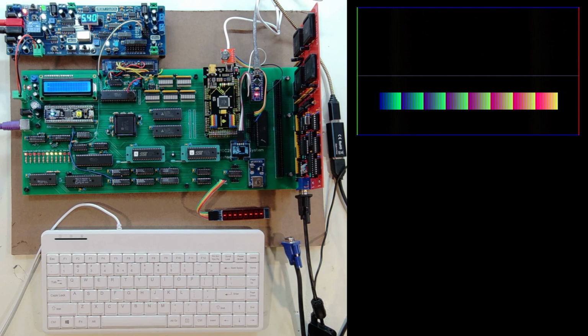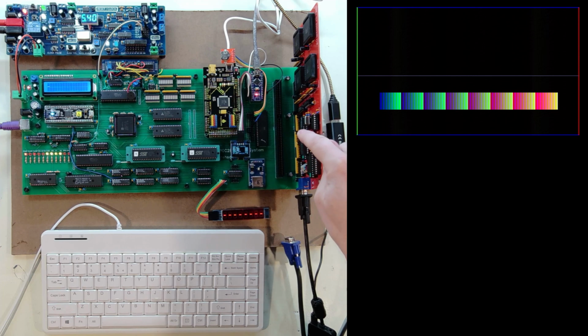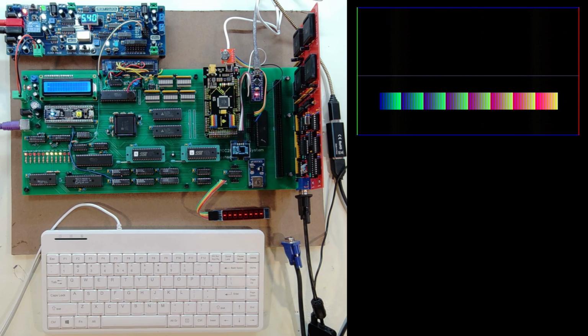That's probably it for this video. I've spent about half an hour here just going through how I'm accessing the memory, how I'm starting to program it, and showing the current output, which honestly, I'm happy with. I'm not seeing a lot of artifacts. The only minor issue is the very first column. I get a little bit of noise, but I think that really comes down to how I've done the timing for my vertical and horizontal refresh signals in my PLDs over here. I could probably tweak that, but it's close enough that I'm really happy with what I've got. And the output both to my LCD and within OBS are picking it up nicely, and that all seems good.